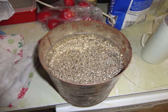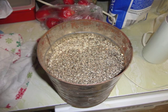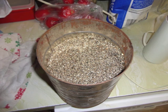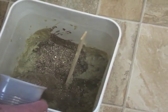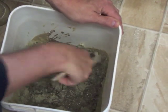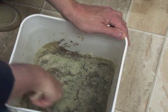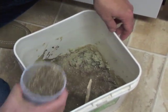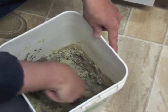This is the last ingredient of our homemade kitty-litter-based refractory clay and insulator for our forge: vermiculite, a naturally occurring mineral. It's very inexpensive — I bought a big bag for $4 several years ago. We're going to mix it in for its insulating properties, its ability to withstand heat, and also to hold the mix together. We don't want to add too much, so I'll start with a plastic cup full of vermiculite and begin mixing it in to absorb some of the water and thicken the mix. It's getting really stiff now, and that's what we want. If we make it too wet, it takes too long to dry and will also crack more.